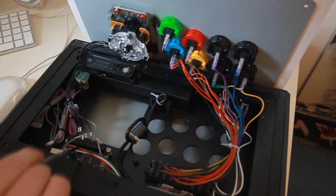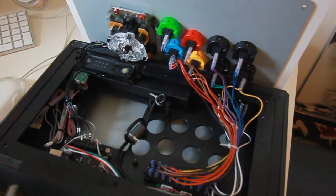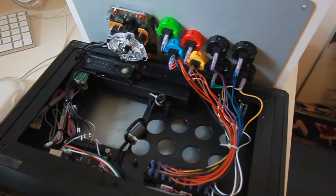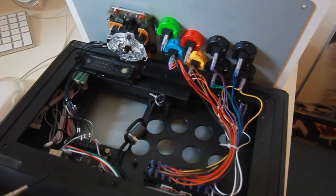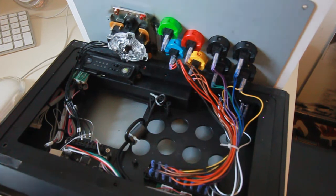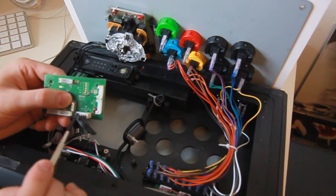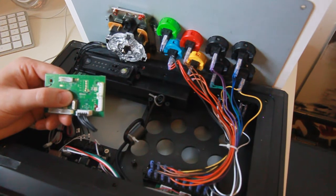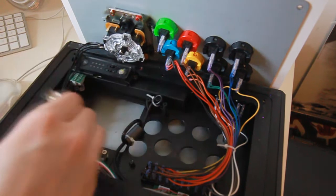All these buttons bar the start and back buttons are on one side of the new board, which makes life very easy. You've also got two grounds, which are the corresponding wires from here. Once that's done, the wires from the joystick go into this side — again extremely easy. You can have a diagram, or use the diagram on the primer from Focus Attack. However, looking at the old board, it tells you which one is which. From left we have ground, right, left, up and down. Cut one off at a time, cut back the sheath, insert into the right terminal, screw it down.